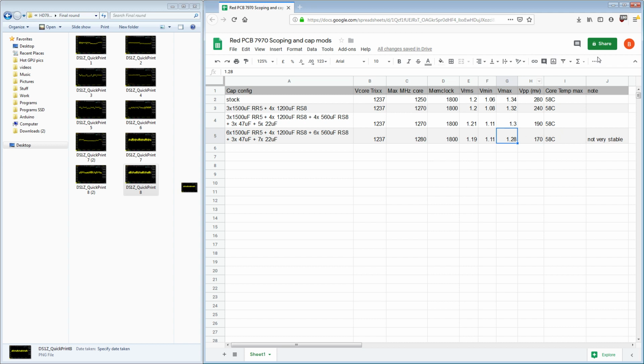Or if your voltage overshoots so hard that... the thing is, you'd need a lot of overshoot to really cause an issue. Because the exposure is so short, I would assume you'd have to hit gate breakdown voltage levels, and those are going to be really, really high. But admittedly, if you're pushing super borderline voltages where degradation is measured in minutes or hours, and you have major overshoot, yes, I could see that instantly killing the CPU or GPU at random. That would actually make sense. But at normal voltage levels, the overshoot shouldn't get anywhere near insta-death, right? And since it's short spikes, it shouldn't be long enough to cause significant long-term damage.